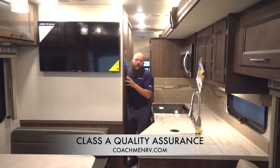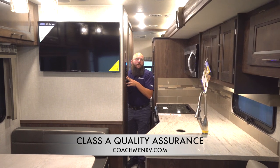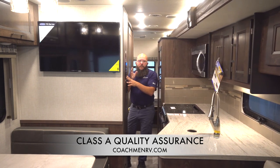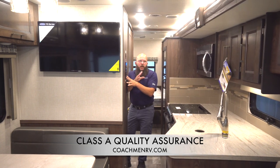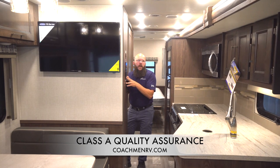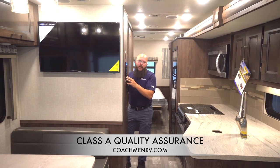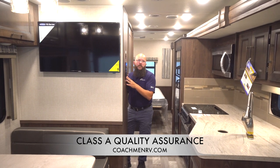Upon that happening, you're going to reverse the room and run it to the out position. You may notice at this point that the room may not track straight — you may see one end lead, or one end take off ahead of the other. It might bog down on its way out. Just stay with it. If it starts to get out of time a little bit because it's not programmed, simply let off the button, and you can always just pulse it before the other motor disengages.